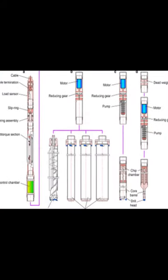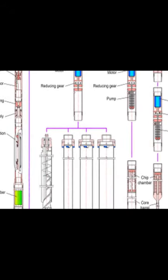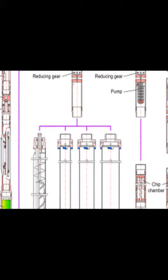The upper portion of the drill is similar across all variants, while the lower portion includes an auger core barrel, reamers, a core barrel for ice and debris ice drilling, and a conventional geological single-tube core barrel or custom-made double-tube core barrel.